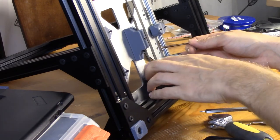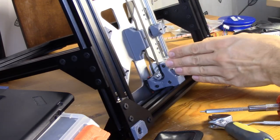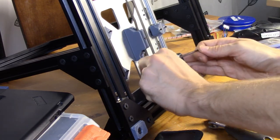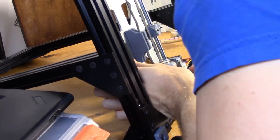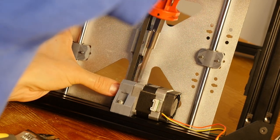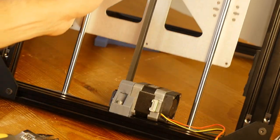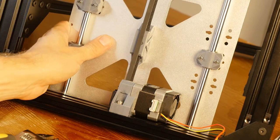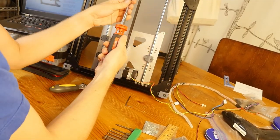And for the motor, it seems to be aligned on the side of the... Actually, it's a little bit... I can move the motor head... I think I still have a little bit of room to move the coupling on the motor. Loosening the screws here and here. Then I'm moving the coupling, and then I'm tightening the knots again. So maybe now this thing looks even. I'm going to move the idler a little bit to the right from where we're looking.